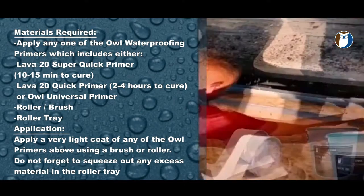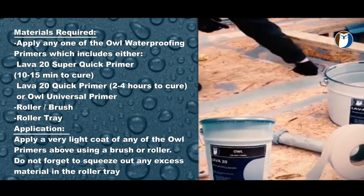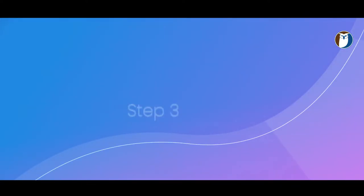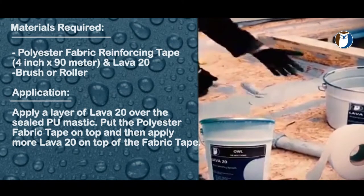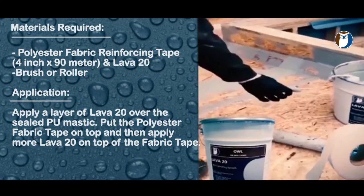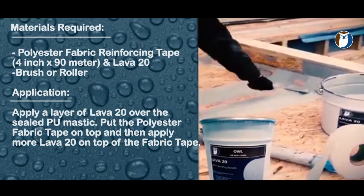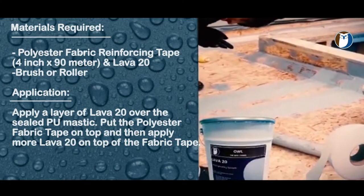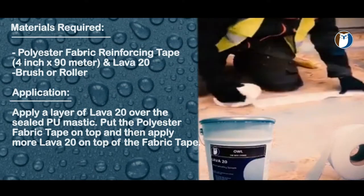A primer unit will usually cover about 20 square meters per tin. The next type of tape reinforcement is using the polyester reinforcing fabric tape. For this process, you use some of the Lava 20 liquid rubber waterproofing and you embed the polyester fabric on top of it and then you apply more Lava 20 on top of it again, creating a liquid followed by mesh tape, followed by liquid layer. This process is called a wet-on-wet application.